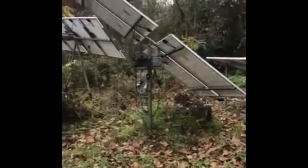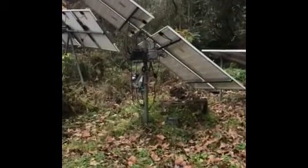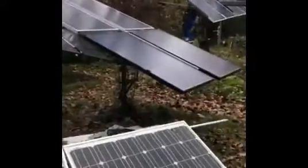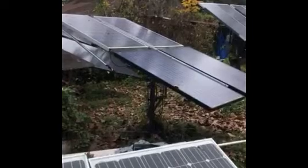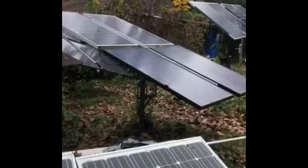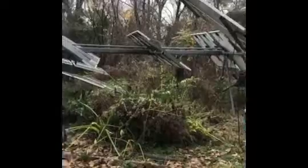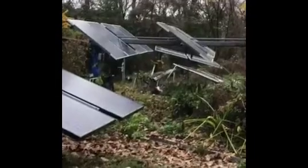This one is similar. It's four-panel. It's got one motor on it, but it's closer to a two-axis in the sense that there's an angle adjustment for the tilt for the sun at noon, and I'll detail a little bit about that too. This one is just kind of a standard single-axis tracker. It's accurate in the spring and fall, but in the winter and summer there's a little bit of angular difference between where the sun is and where the panels face. And in the distance over there is a 16-panel, two-axis tracker. It's of a type tilt-tip, and I'll explain that also.